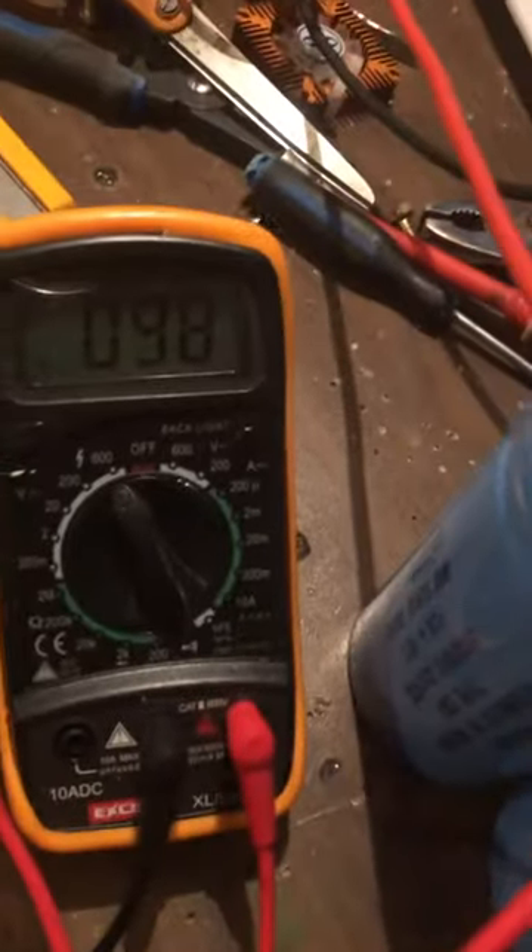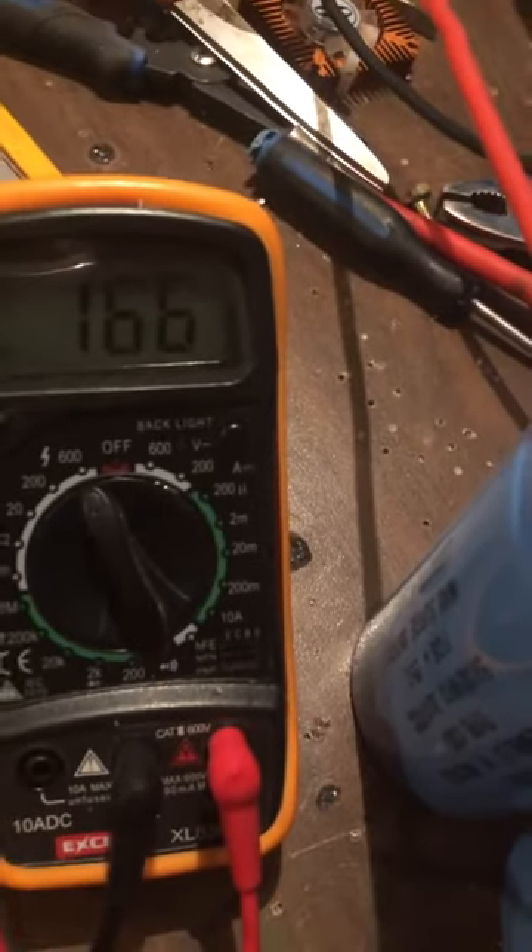I've removed the midpoint. We're still having that slight issue, although I'm getting much higher voltage. I've turned the power supply up to put a little more power through it, so we're pulling about between 30 and 60 watts. We're getting about 160 volts out of that right now.